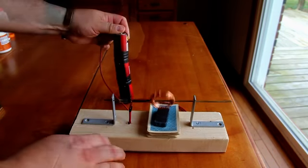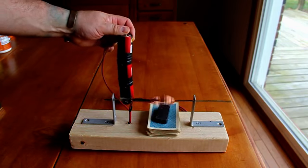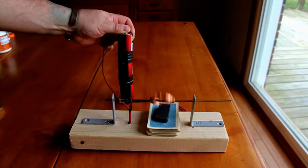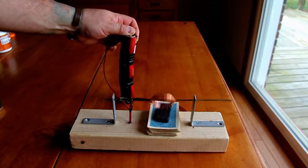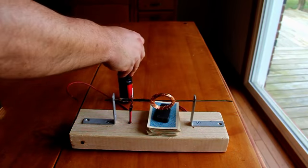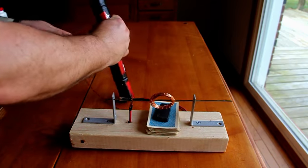There are all kinds of designs you can use to make a half motor. I picked this one because it's simple to build and sturdy enough to survive children. Also, if you want to, later on, you could convert the half motor into a full motor by bolting on another electromagnet to the metal bracket that supports the coil.